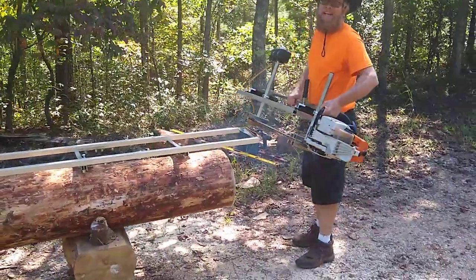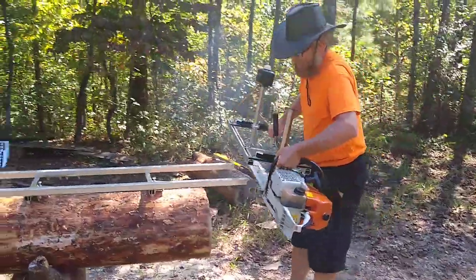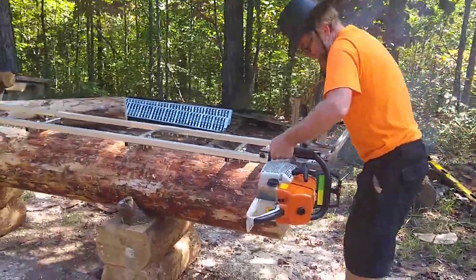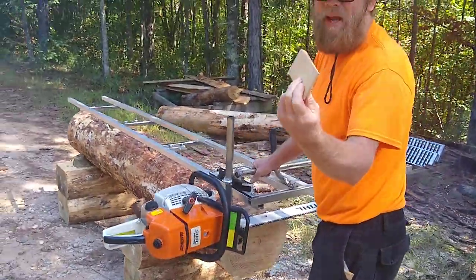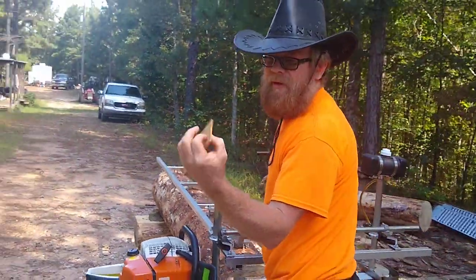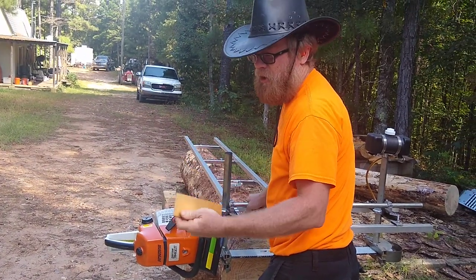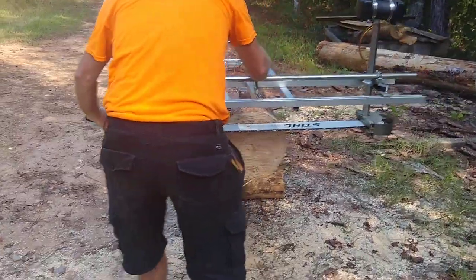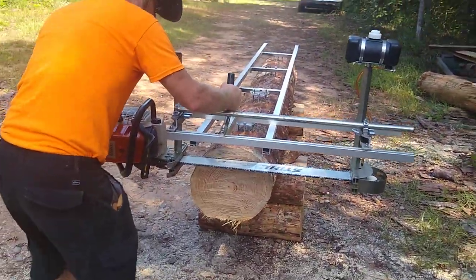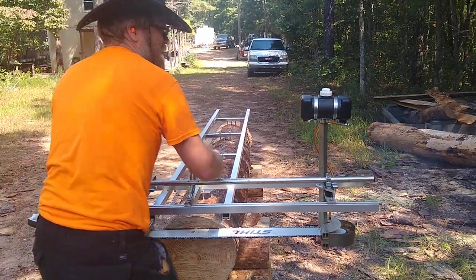The rail itself is nine feet; this log is eight feet, so it gives me a little extra. I can set this here. I also have my wedges ready — they're about one-eighth inch at the small end and about three-eighths to half inch at the larger end.